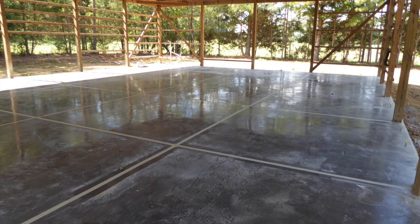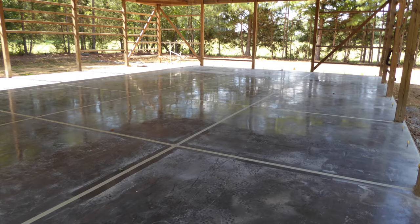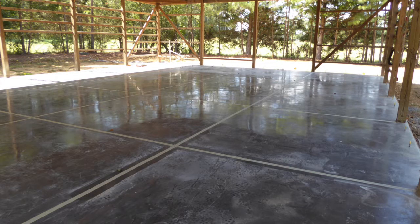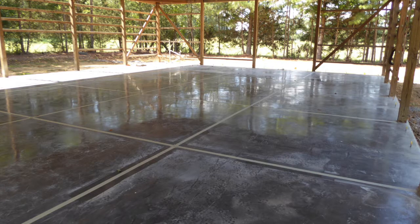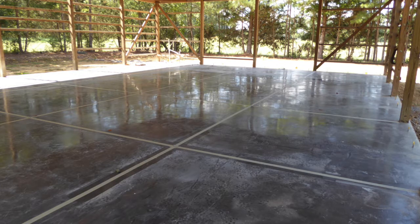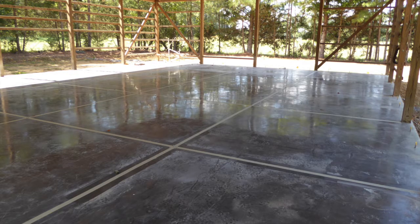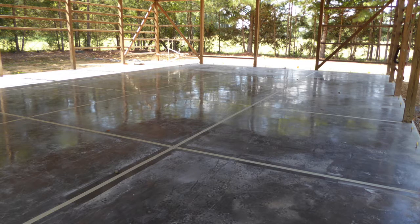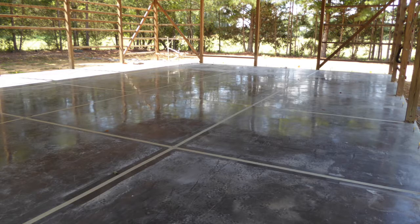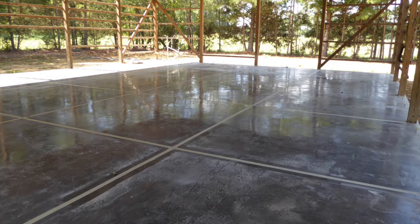After the concrete set up, my next immediate job for several days was to fill all the crack seams. Until I actually did it, I really had no idea how much time would be required for this job. A 40 by 60 foot floor with seams every 10 feet in either direction represents 380 lineal feet of crack needing to be filled. And for me at least, the work was backbreaking. You're down on your knees, on hard concrete, you can't go fast, the work is slow and methodical.